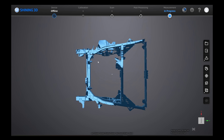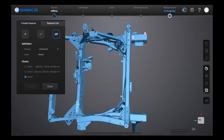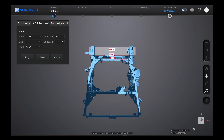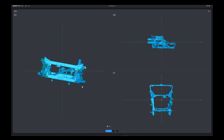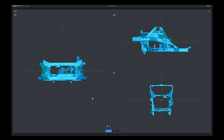While this has evolved into a really great piece of hardware, it's not perfect and no tool is. One of my biggest gripes when it comes to working with the files on a PC is that it's not compatible with the X-Star software that the Einstar Classic scanner uses. It uses its own standalone version called Star Vision, which is kind of like a lightweight version of the interface you'd use on the scanner itself. This means that my favorite feature in X-Star software — the 3-2-1 alignment feature to quickly align your scans to a coordinate plane — is not present. When the scanner was first released there was no means to align scans to a coordinate plane, but they've since added a feature to do that, though it allows for freeform movement rather than defining a specific plane. It'll get you in the ballpark, but if you're using it for engineering purposes it's not going to be ideal.